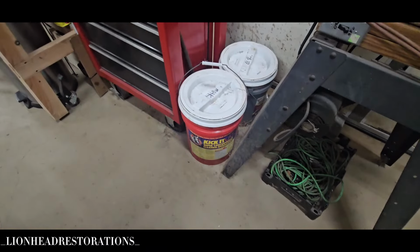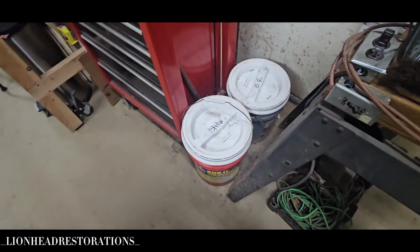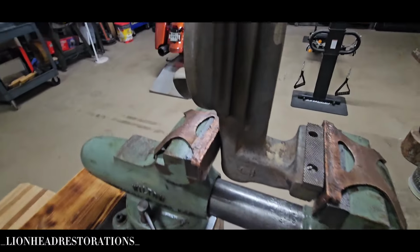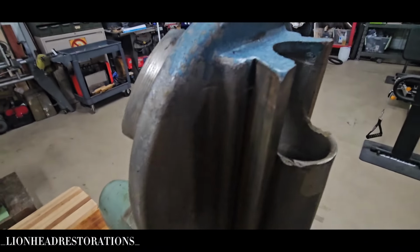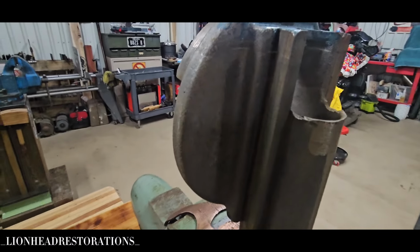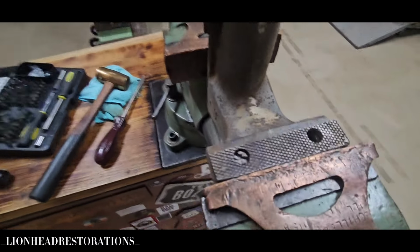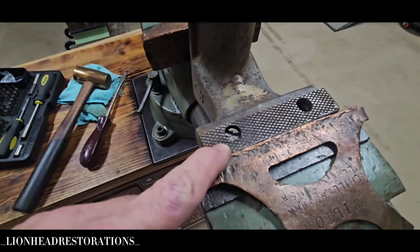That Simple Green, Purple Power work as well. You have to leave your parts in those for about a week. And with the Mulehead Kick-It, this was sitting in there for about 18 hours. And all I had to do to get the paint off was rinse it with water and scrub it with a toothbrush. So hopefully this works, because if it doesn't, I've got 2 other things I'm going to try.